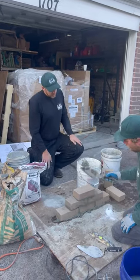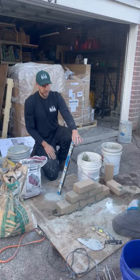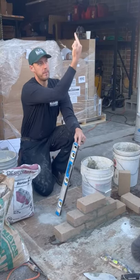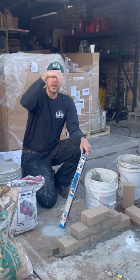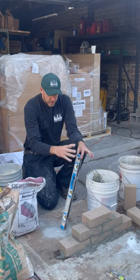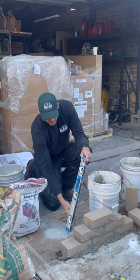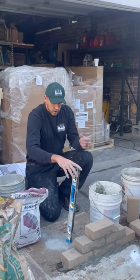And the reason for that is this, or your level actually. If you build a fire teepee style, like this, you're able to ignite the wood on 360 degrees of the surface area going up, which creates a very strong hot draft, and it'll break through that cold air pocket. A lot of times chimneys will have cold air coming down the flue when you go to start the fire. You'll open the damper and you'll just feel this big rush of cold air. So I'll teach the homeowners: build a teepee style, get a little newspaper, put the newspaper up inside the throat of the smoke chamber, and you can see that flame start to suck the smoke up. And then bring that newspaper underneath your little teepee fire, and it will burn 360 degrees of surface area of that fuel and create just this beautiful, hot, good drafting fire.